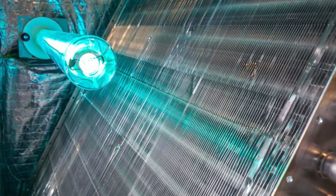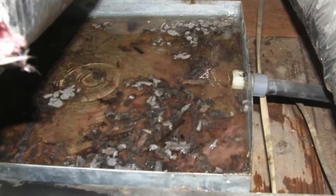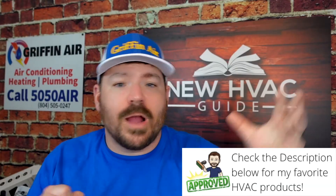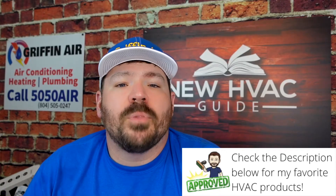What I would argue is that if you install a UV light in your air handler or furnace, it will inhibit things like mold, microbes, and other harmful things that can grow on your evaporator coil or in the drain pan. Yes, you're not cleaning the air directly, but without that UV light, air passing through could pick up those harmful things and blow them back into your home.